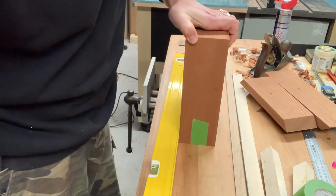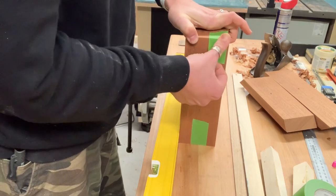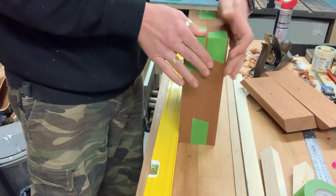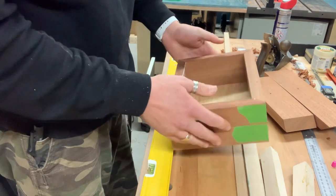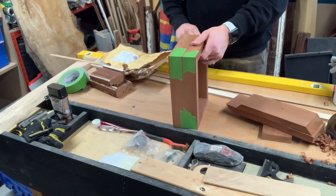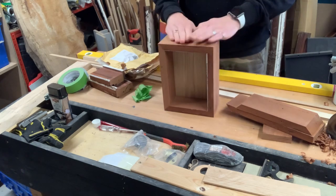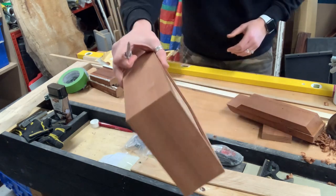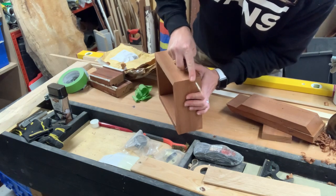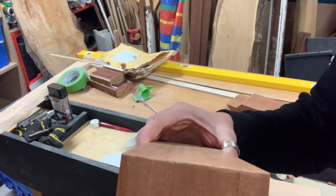I pretty much got away with it. But now that all four corners are joined I can see one corner has a slight gap — I think because of that piece that wasn't sitting perfectly flat on the table earlier. It's close enough and I've got a fix for it: I take the edge of a screwdriver and rub it at an angle, effectively bending the corner fibres of those two mitres into the gap so you can't see it anymore.